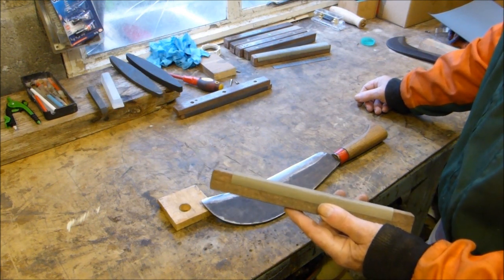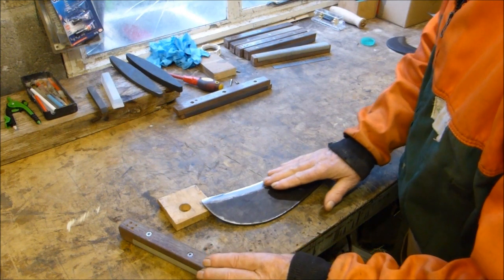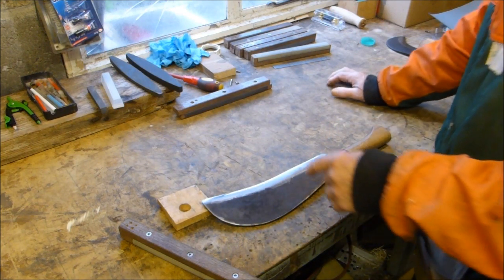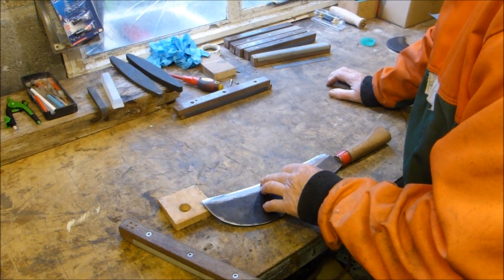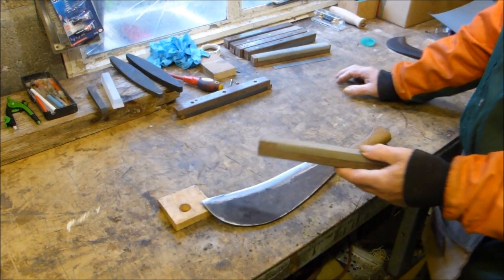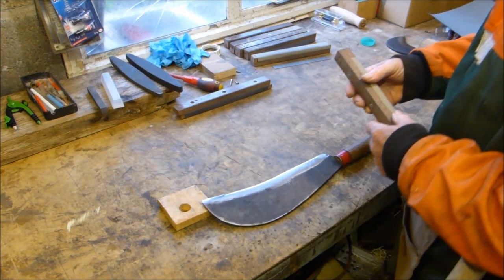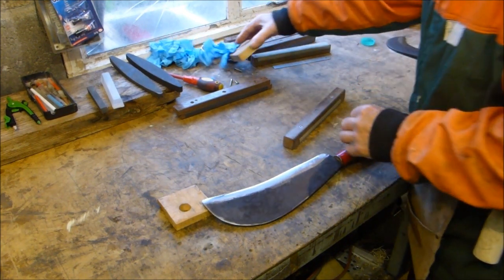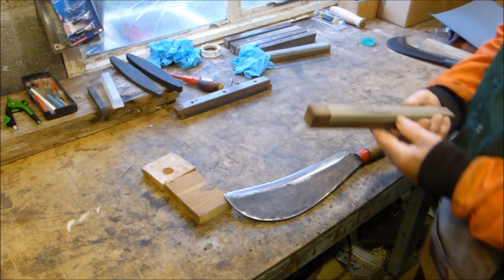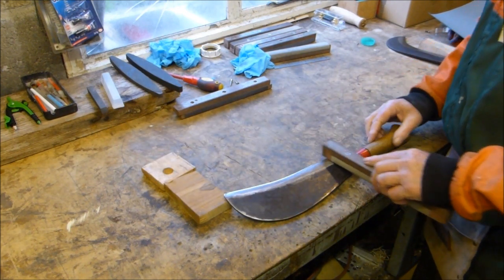But I use that 7,000 for a purpose, because when you sharpen that at 3,000, it's the width of the blade, and the blade's quite thin, I'm a bit obsessive with getting the thin blade, and therefore you can lose your edge if you cut in some very hard material, which you shouldn't do with a billhook. If you should do, then you might take a little bit off your edge. You might even chip it, because the edge is very thin. So what I do is at 3000, I then increase the thickness of that to a thicker edge. And with that 7000, I go over it very lightly, just like that.